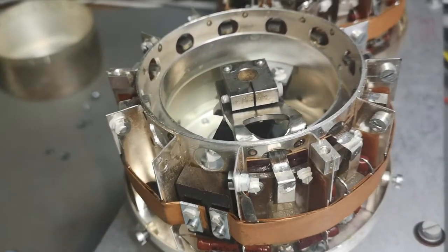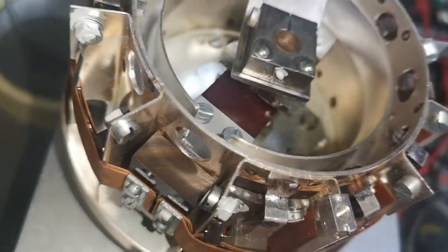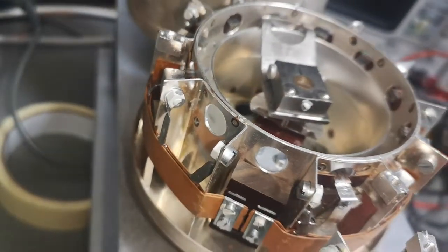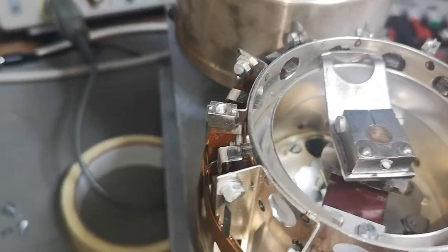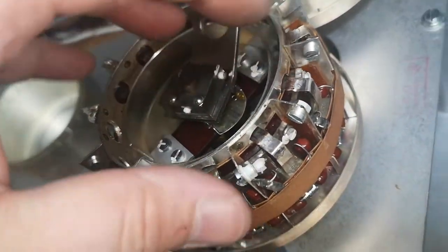It's a really, really beautiful construction. There's a thin wire that goes up here — this is the output — and it goes through this one and up again. Then the next one goes up here, and again the output goes to the next one. They want the output to be as far away from the input as possible. It's a really, really beautiful construction — it probably took quite a while to design and manufacture all this, and figure out how to do it the smartest way with everything in the right impedances.